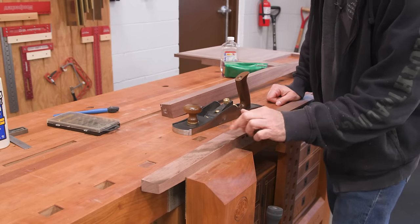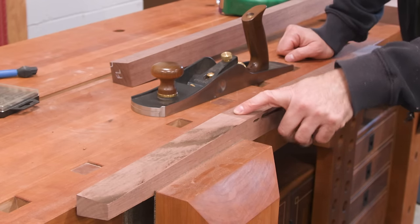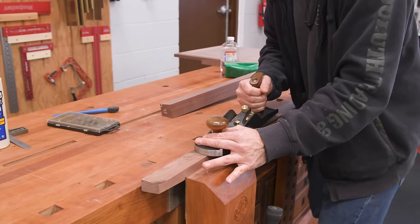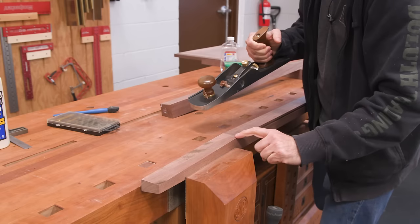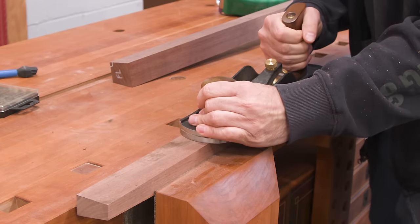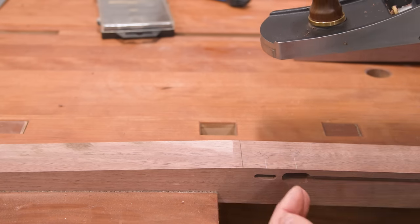At the workbench we can do a little cleanup — not just to clean up the burning, which you can kind of expect on a cut like this. We'll be able to plane or sand that away. What I'm really focused on is my pencil line. I want to make sure I remove material back to that pencil line and no further — got to be real careful with that. A jack plane is a good tool for something like this so we can keep that surface nice and smooth and flat. I'm a little off and not parallel with my line, so I'm going to correct that as I go — removing more material on one side to help straighten this out.